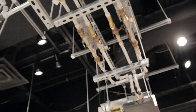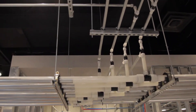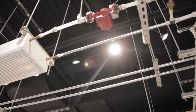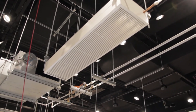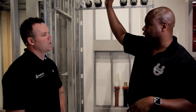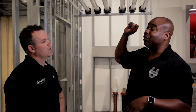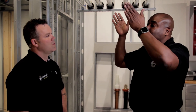The best part about it, you asked about this shielding — the shielding is the key, it really is. What we do here is this called PEXA pipe support and it gives us three advantages. One is it gives us that rigid pipe, so our hanger spacings are like six foot or eight foot in length, just like your regular rigid piping system. We also now are plenum rated because of that PEXA pipe support. The other thing you have to consider is we're now also going to control the expansion and contraction of it — with the hanger.